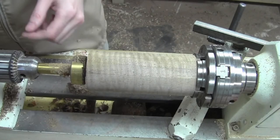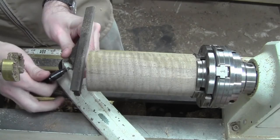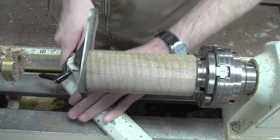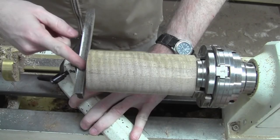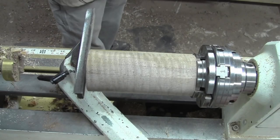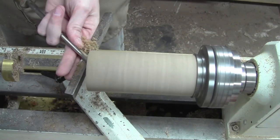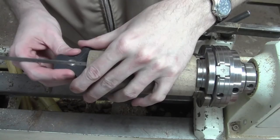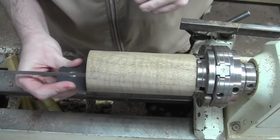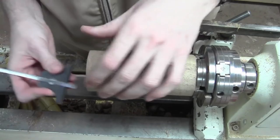I went a little deeper than a half because I need to face this front edge. I'll just face it right now — moving the tailstock over and bringing the tool rest. I'm going to do a really tiny scraping action, bringing it in a little bit so it's pointed diagonally rather than concave. I want this outer edge to sit pretty flat when you set it down on a table. I'll do that with my spindle gouge. Our little depth gauge shows we're right about a half inch — actually a tiny bit deeper, probably less than a thirty-second, which is fine.